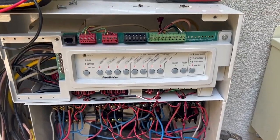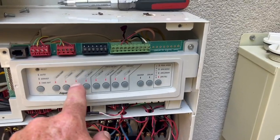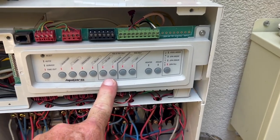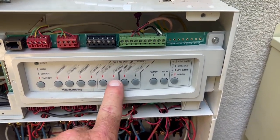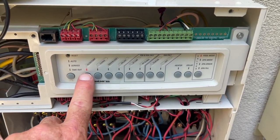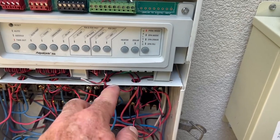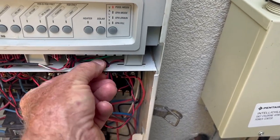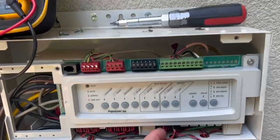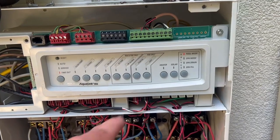If the fuse blows, then you're going to find that the particular relay associated with it is shorted out and causing the power to be shorted. But typically it's not one of these relays that's causing the problem. More than likely, it is actually the actuator. So you're going to want to start changing your actuators and looking to see whether that trips the fuse. Generally speaking, about 99% of the time, it's one of the actuators that are plugged into these ports.